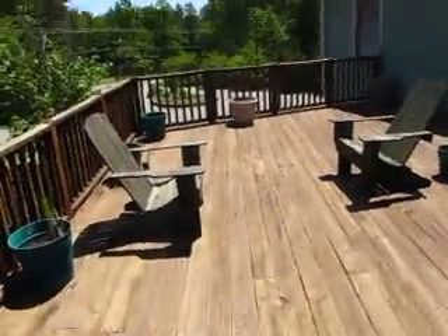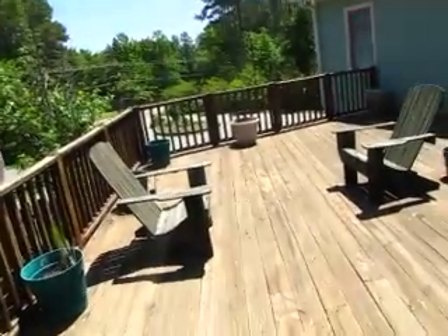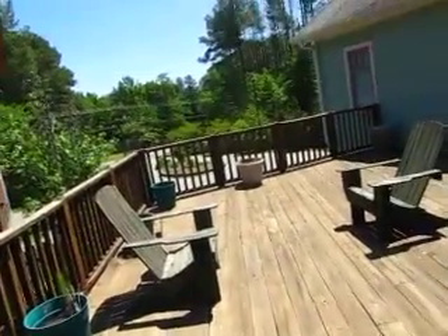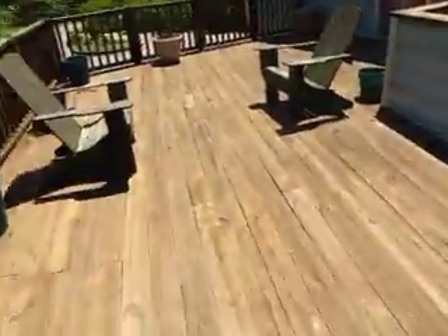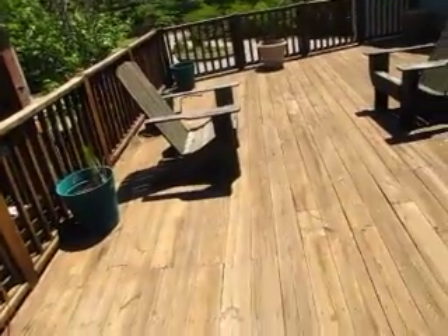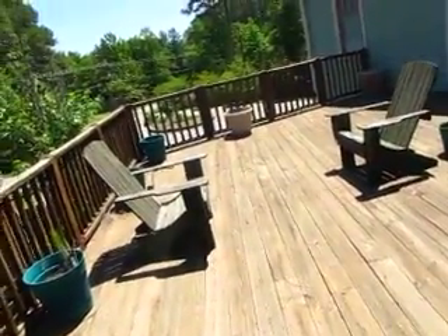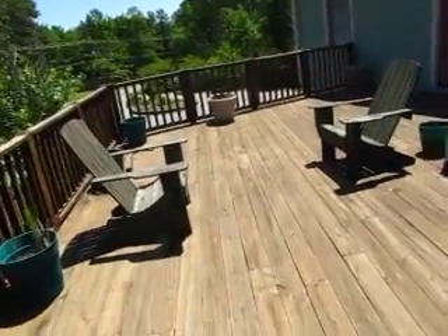Option C that makes sense is: okay, yes, the decking boards look horrible — do the rail new, new decking, the new two-by-eight, basically everything up here we see from the visual, all brand new, with the realization that I need to let this bake in the blazing August sun to get the moisture out, and think about putting a sealer on somewhere around September or October.